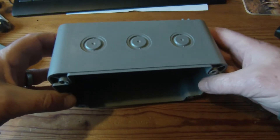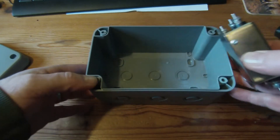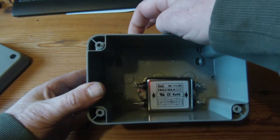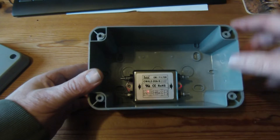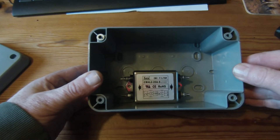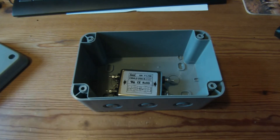I'll see, drill those out for these grommets - what do you call them - for the cables. Yeah, so that should fit that in there, probably somewhere down the bottom. Bring the cables in either in the side or down the bottom, out through the top to where the VFD is going to be. Might even be able to run the motor cable through, so I'll be able to get it planned on that and restrain it as well, which might solve the restraint problem with the cables.